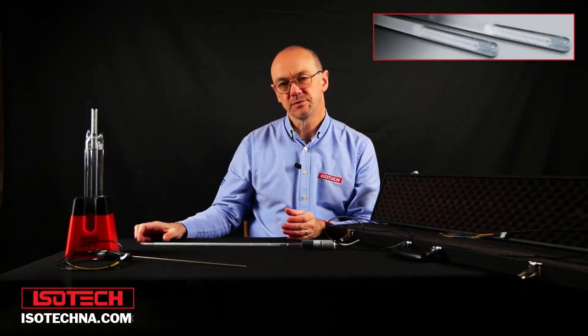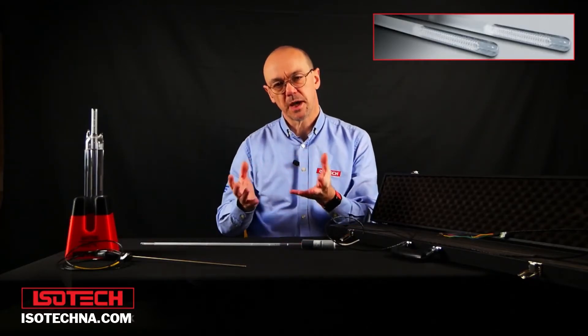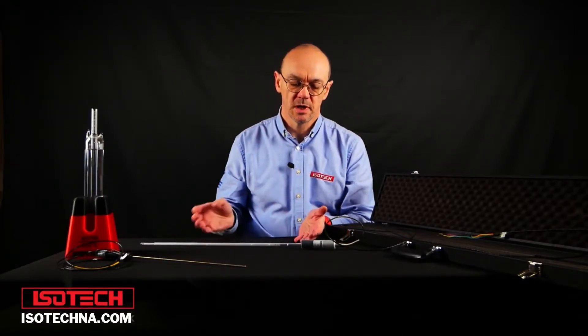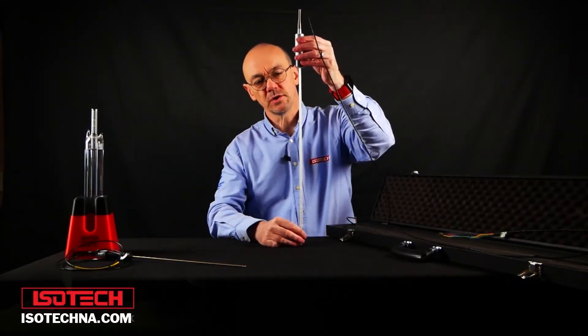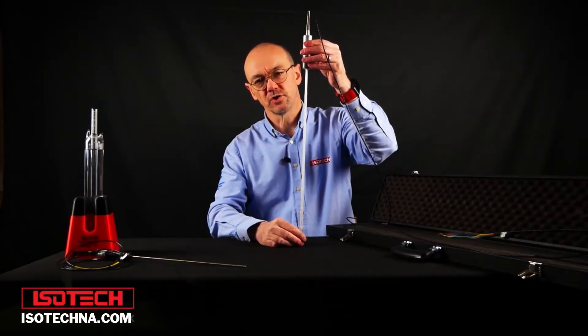The coil at the end here is very different. This coil is open — the wire is free to expand and to contract. The wire used in an SPRT is higher purity than an industrial thermometer, and that makes these devices very prone to damage. They need to be handled very carefully. With vibration, knocking, or dropping an SPRT, the calibration will shift.